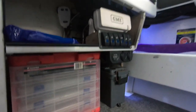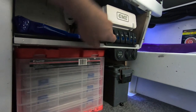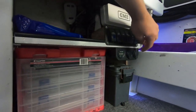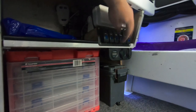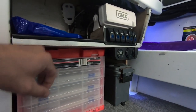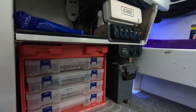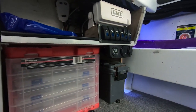Under the console, I've shown this before in previous videos, but I have my switches that I ran in myself — I rewired this whole boat myself. The bait pump, all the regular switches plus a few additions are here, including the radio and 12-volt sockets and USBs. They're all individually switched and powered. There's also a super cheap auto special tray underneath here for my terminal tackle — hooks and sinkers — though I usually fish jigs and plastics.